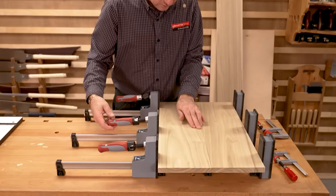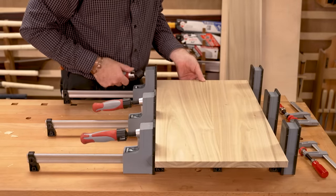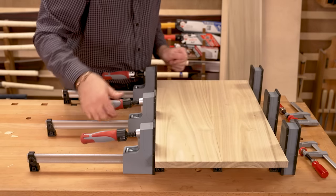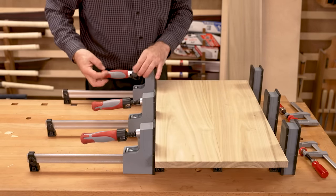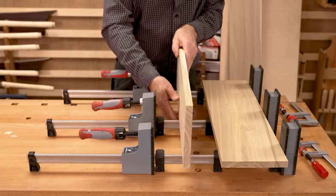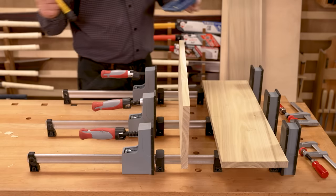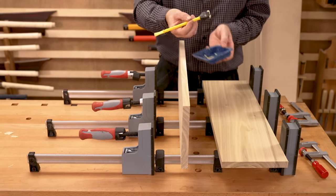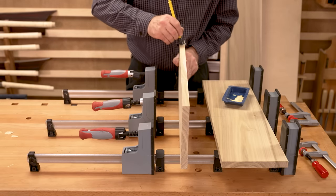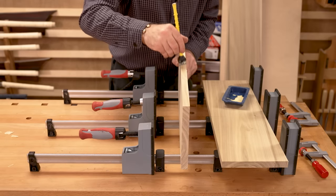Just finger touching, getting an idea. Looking at what's going up. So not too much pressure on this. Just trying to make sure we lose anything as a join line and they're nice and straight. That's not bad, okay? I can cope with that. So we'll undo. We need glue on one surface, so let's get the glue back in. We'll put the glasses back on to make sure we get it on the right bits. Don't want too much off the edge. Now make sure we control it.